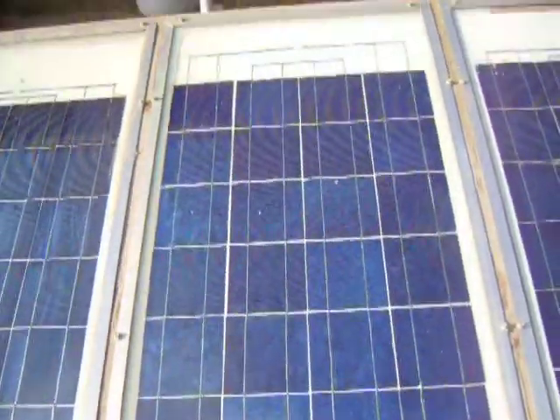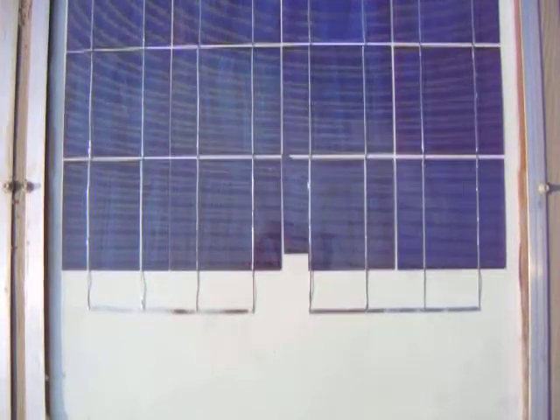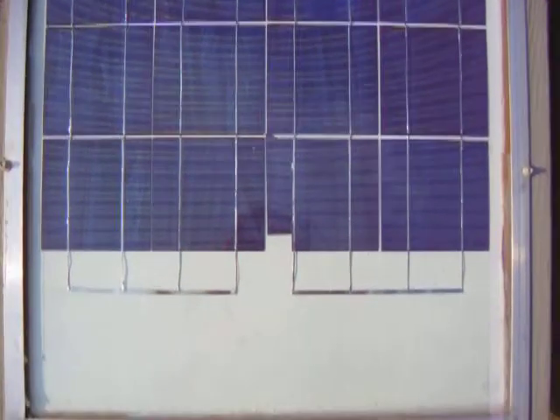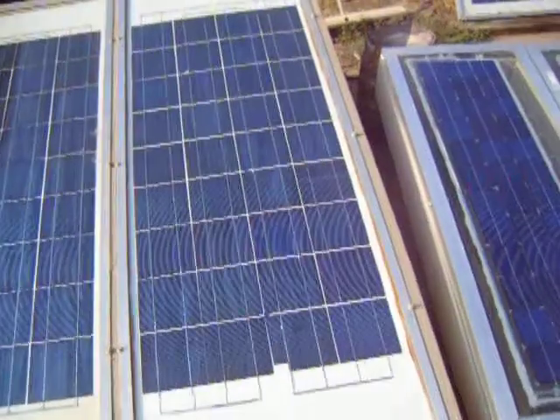The cells were thicker, and I was able to make pretty nice panels — they did pretty good. I got to the last one and put it together, and that one was broke right there and I didn't know it. I'm sure that cuts back on the whole solar array. I may have to take that apart and fix it, or I may just get a whole new set of cells and glue them to the glass with Solar Tite or Silgard 6100, whatever is cheapest.